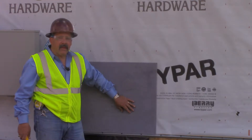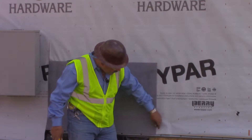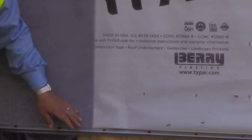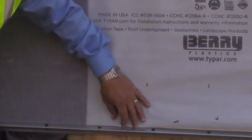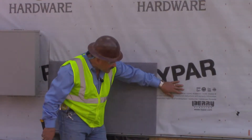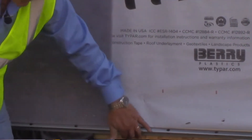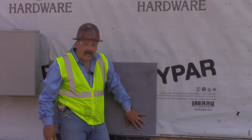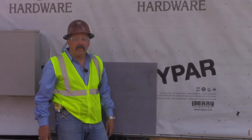We've installed our first piece of lath net on the weep screed. As you can see, we've attached it so our drainage mesh sits on top of the triangle of the weep screed. Adjacent to that is our WRB weather resistant barrier that sits at the same location at the top of the triangle. Any moisture that comes down this wall will be afforded the opportunity to go into these holes, drain out underneath, and exit the building. Our next piece will come and lap over this, and from here we will shingle all the way up the building with our products.